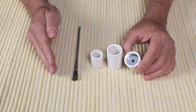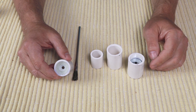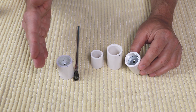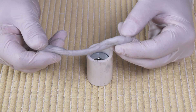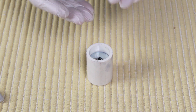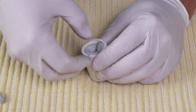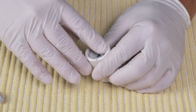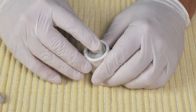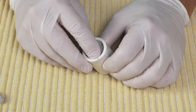The next thing you want to do is get your epoxy clay and work it into your nozzle so that it forms a convergent. This convergent also acts as a heat sink and keeps the washer from superheating and melting through the plastic. I've got the epoxy clay kneaded up into a roll here — I usually make more than one at a time to cut down on waste. Roll it out a little bit, then start working it into the nozzle. Make sure you work it down into the corners on the side, because you don't want the flame front getting anywhere into the nozzle area where you don't want it. This provides a seal to help keep hot gases from going down the side of the nozzle.